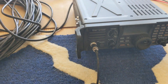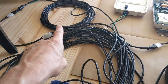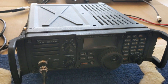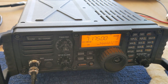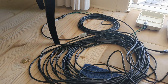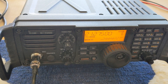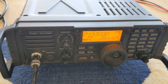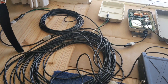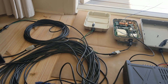Let's add another 30 feet. Now we've got a little over 130 feet hooked up through this adapter, going from this cable into the cable that came with the tuner — 130-something feet. Came on — that's fine. That's a lot of cable. No problems. So the AH4 has no problem supporting around 132 feet of cable. You can mount your AH4 130 feet away from your radio, no problem.